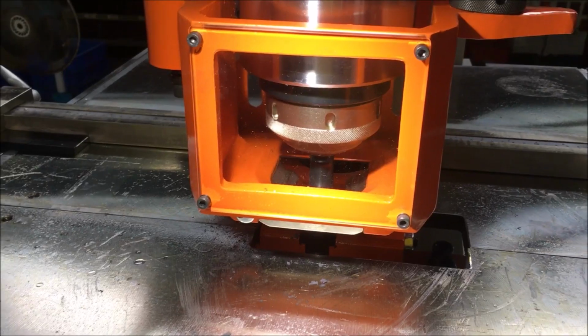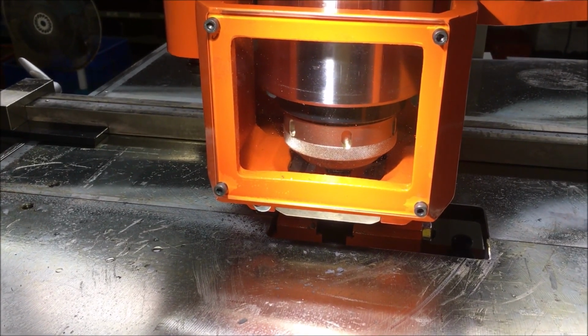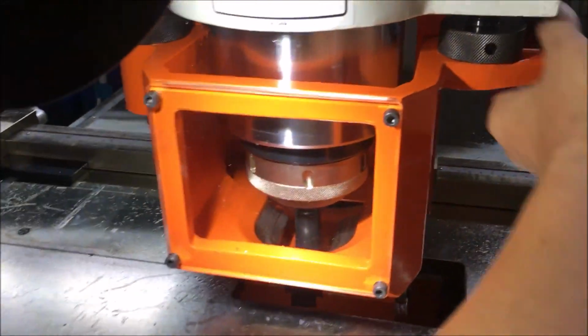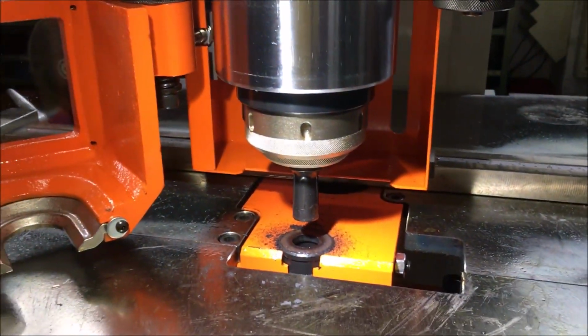About the operation, when you press down the foot pedal, you move down, let go halfway, you stop. Now continue going down. You can stop anytime at the center. If I open a stripper, because of the interlock, it will not go down.